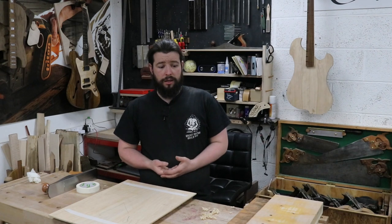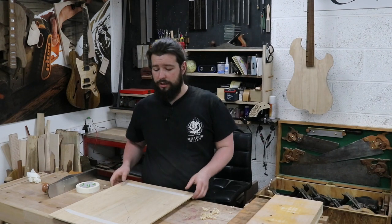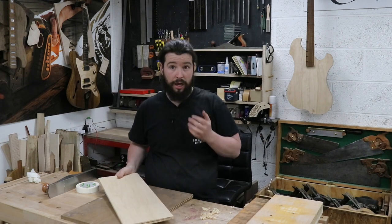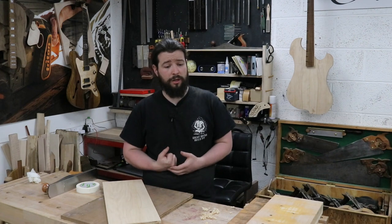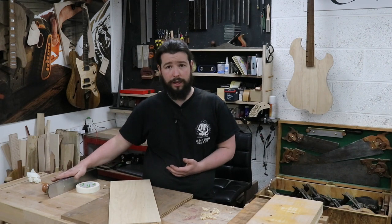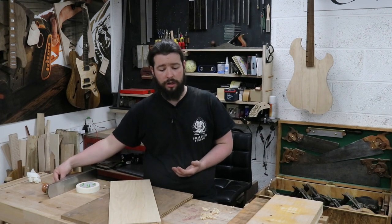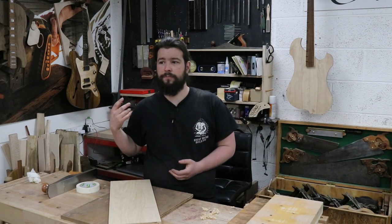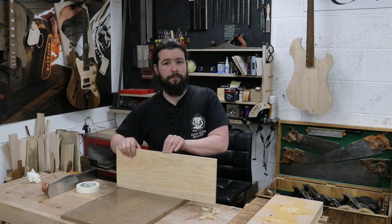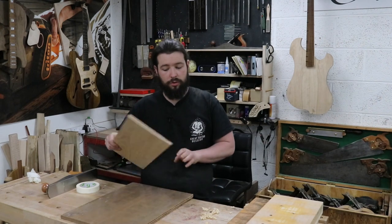Suitability is something I get asked quite a bit. For something like this, which is about five millimeters thick — so quite thin — this method is ideal. Anything up to about 15 millimeters, maybe even 20mm, is perfectly fine. You may have to sharpen your plane a little more for thicker stock, but for thinner stuff, anything that goes into a drop top, absolutely all day long. My rule of thumb is: anything that, when put in a vise, doesn't give you enough surface area to run a plane over — that is when the shooting board comes out.